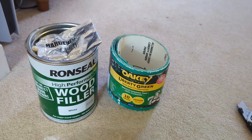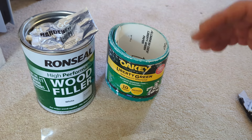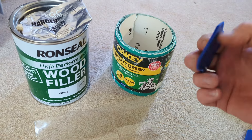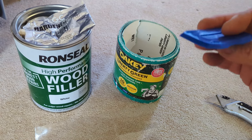It's coarse enough that I'm not going to be there all day long getting an achy arm sanding, but it's fine enough that in 90% of cases it will leave a paintable finish. Get yourself a knife — something to mix up with and apply the putty, so like a paint scraper, a filling knife or something like that. I like to use these silicon tools.